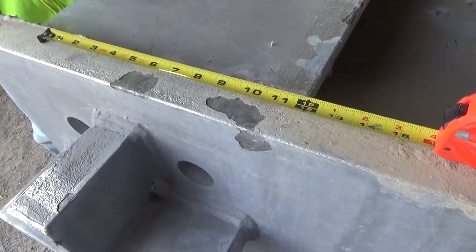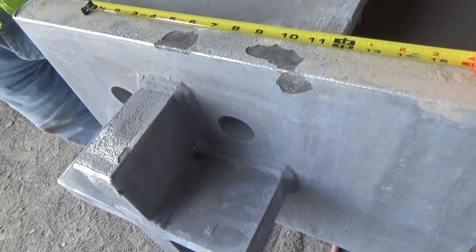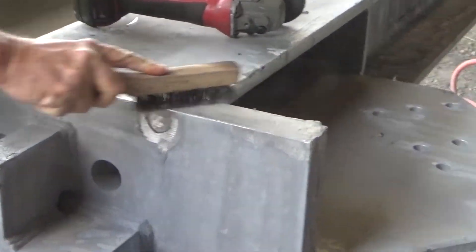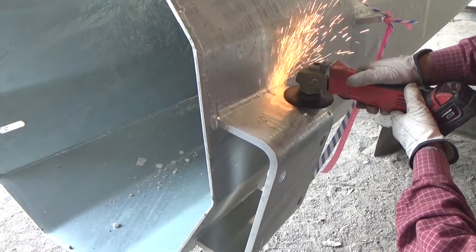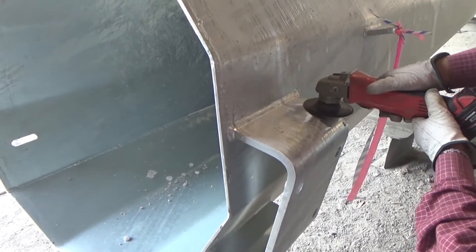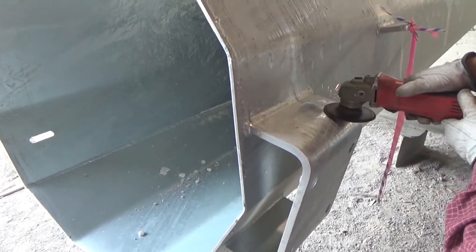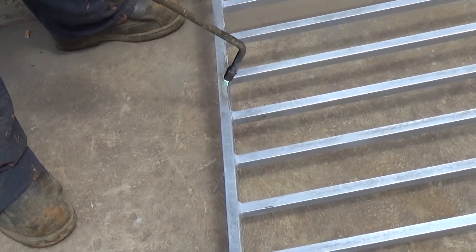Touching up with zinc-based solders is recommended for horizontal surfaces only. The surface and surrounding area should be wire brushed, lightly ground, or mildly blast cleaned before repair. If the area contains weld flux or spatter not removed by wire brushing, weld spatter should be removed by grinding or chipping. Wire brush the repair area during preheating and pre-flux if necessary.